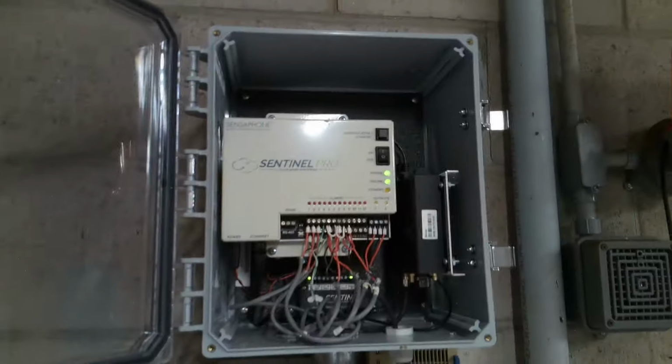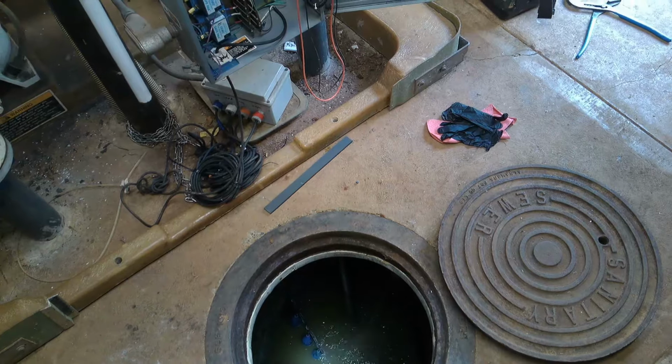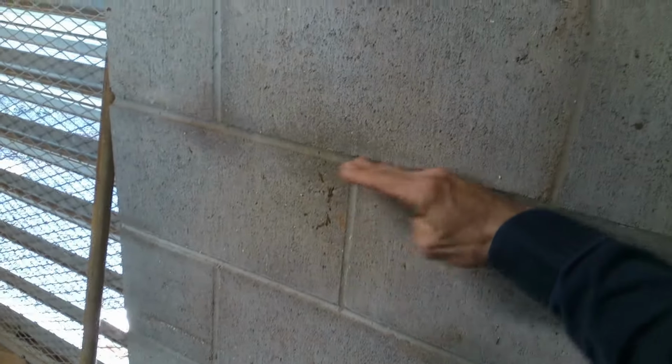They're going to run until it goes down. D3 is true, but for some reason D3 up here is not true. You see that? So they're going to suck it down until that off float hangs. And we want to get notified when, you know, you've got the lowest float that turns it on and off, then the lead one, that's your normal operation. So we usually just wanted to go between those two, off and lead, off and lead. But if the lead pump doesn't handle, the lag pump will come on.